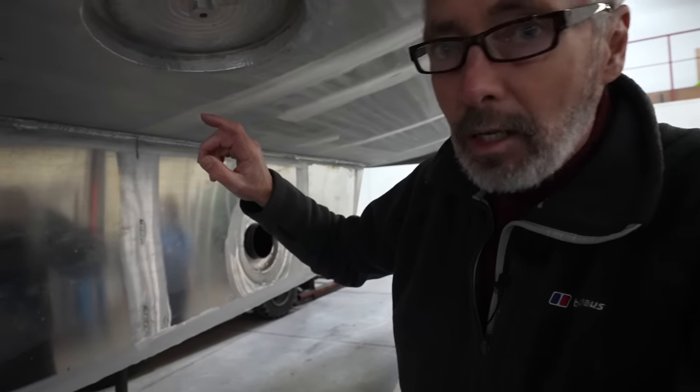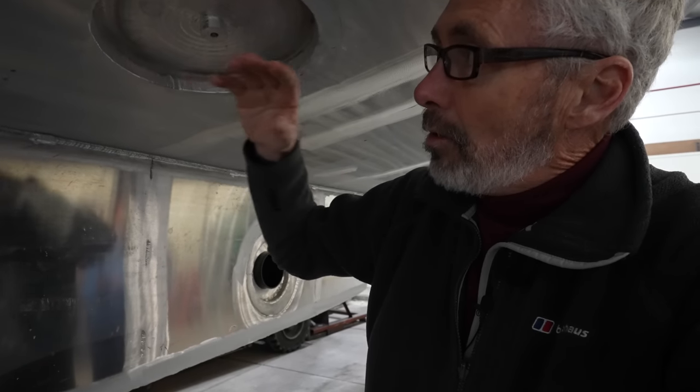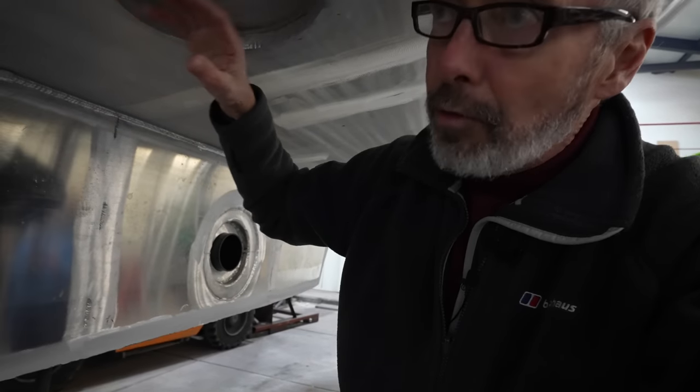To protect the hull of the boat, there are a number of zinc positions. There are four in the bottom of the boat, and a big zinc will fit in here. That will allow this part of the hull to be protected, and yet recessed in the hull, and there are four of these.